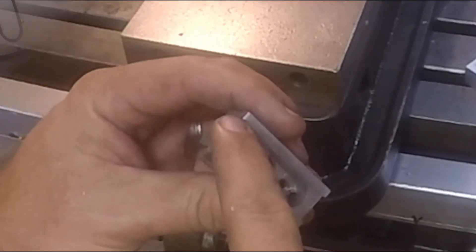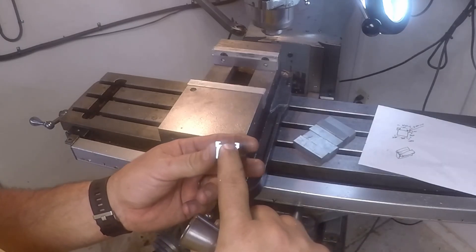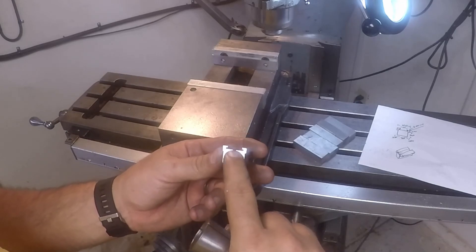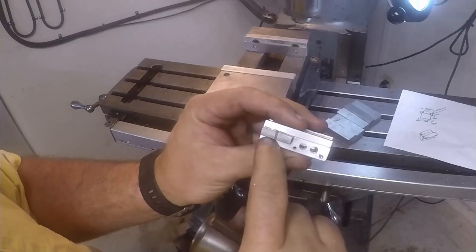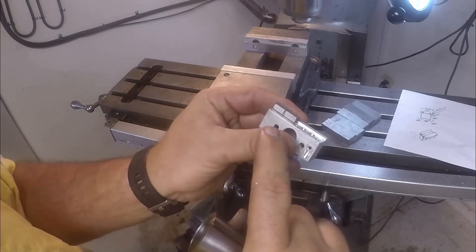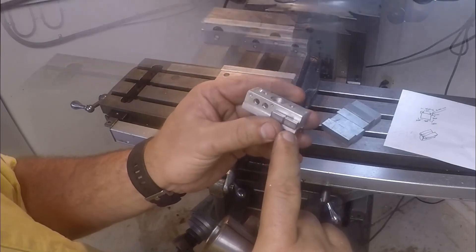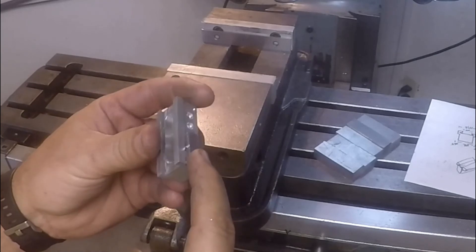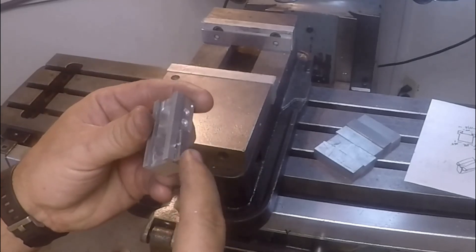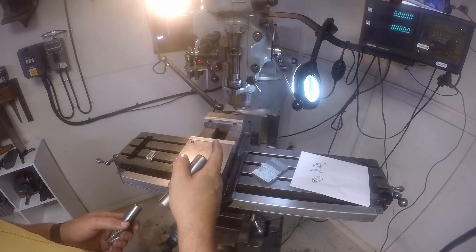Then I'll switch to a half inch mill and cut this out. I've got a little slotting cutter — it's actually for doing little tiny Woodruff keys, but it worked perfectly for cutting this little slot in here so that you can slide the brass portion in. This is actually steel that I cut out and just glued in place, held in there with just some JB Quick Weld. Hopefully that's the only piece that actually has to be glued on. Now let's get these guys squared up, cut off, and cut to size.